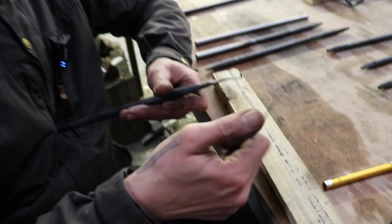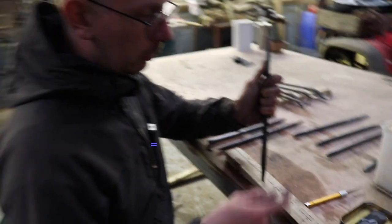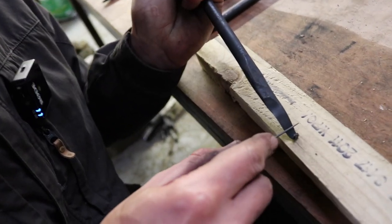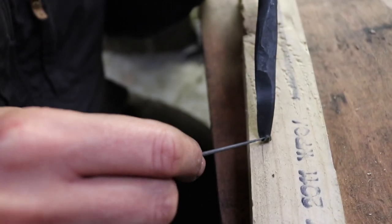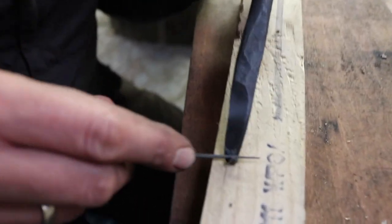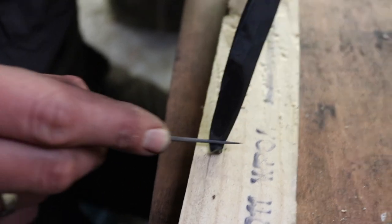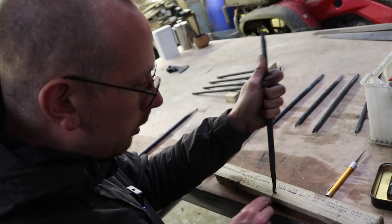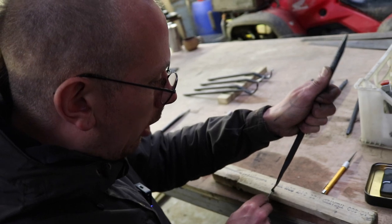Yeah. So I often like to place it on a piece of wood, sitting on a table or having a chopping block or something in front of me, and then you obviously follow the bevel we crowned earlier on the belt grinder and follow that all the way around. Right now it's nice because it's black, so when I start filing, I see what I'm doing because it's getting shiny underneath. And what I do is I move the tool up or in angles. Angles, do you say? It is, yep. So kind of back and forth. Exactly. Back and forth all the way to the tip.